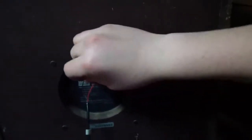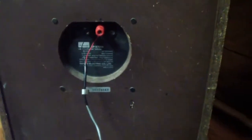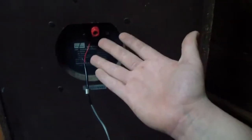One thing you gotta worry about is when these are so close together like they are, you wanna make sure that they don't touch, because then that would cause your amplifier to poop its guts out. Well, if it uses an STK pack, then it's dead forever. If it uses separate transistors, it might be repairable. And both are repairable, but you know, STK packs suck, so, well, not all of them. The early ones were decent, but they're not as good sound quality as the separate transistor units. Why am I babbling on about transistors? Let's get on with this speaker.